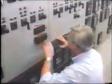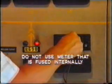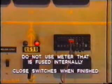With current transformers, we have an opposite problem to the VT. We must remember to never open circuit the secondary of an energized current transformer, as very high voltage can develop across the open circuit terminals — often above 10,000 volts. Therefore, when measuring CT secondary current, be careful not to use any meter which contains an internal fuse. Also, make sure that the CT connection switches are all closed at the relay panel.